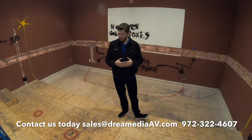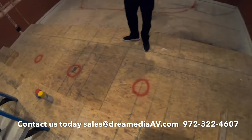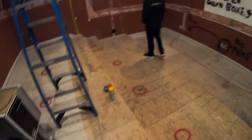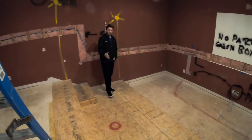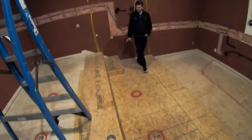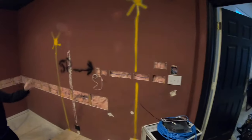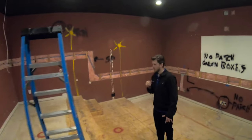You can see we have marked on the floor all of our floor plugs for our seating — he's going to have five seats in each row. The framing's already been done through the riser; we're going to have two rows of seating, a total of 10 seats — first row here, second row here. We're also going to be putting in step lights for the steps to ensure the customer can see when the theater is dark. There will also be three sets of sconces on each side and we're putting the wiring in for that as well.